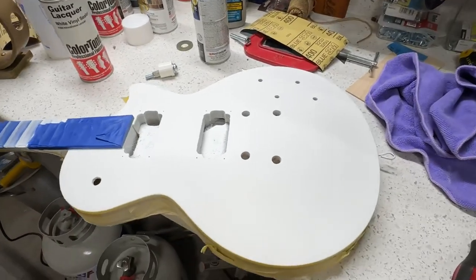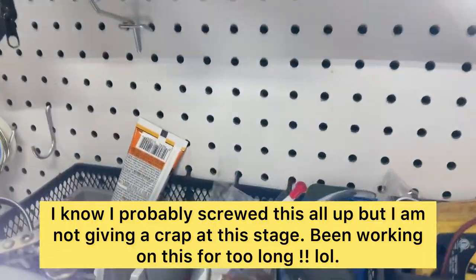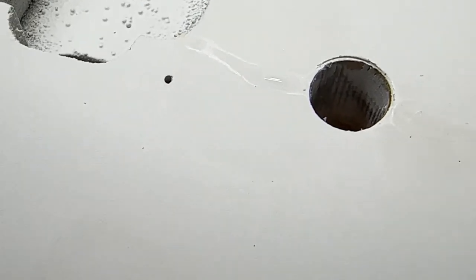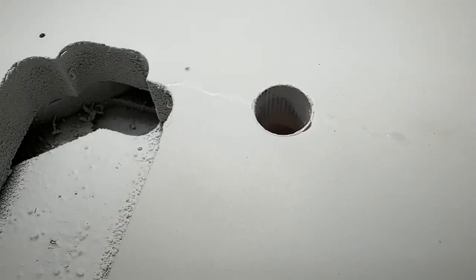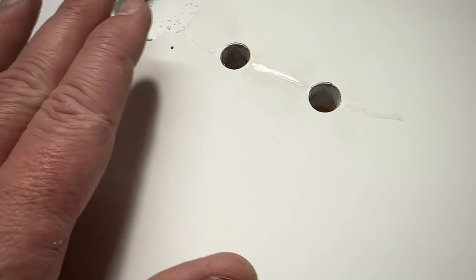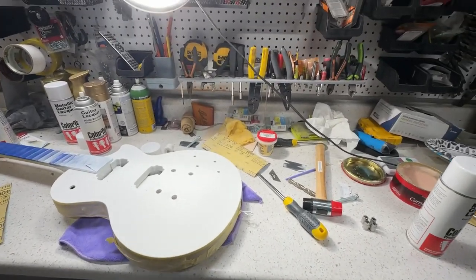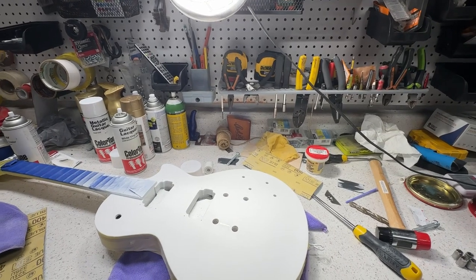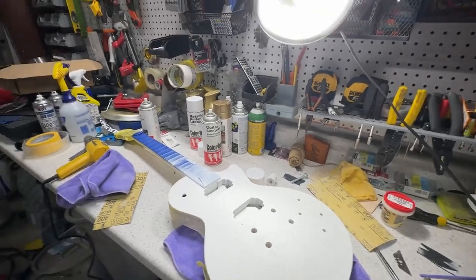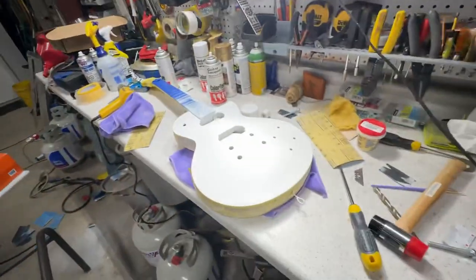So what I did was I went ahead and used some of the super glue to pop those things in — I could see them visibly spreading apart so I said last ditch effort, just went down the line with super glue. Next I'm going to let this dry, take a razor blade and scrape off the excess, then sand it back down. It's about 65% relative humidity and 70 degrees in the paint booth — I bought a hygrometer to measure humidity. In there it's a little less, so I'm going to get that right and hang this up.